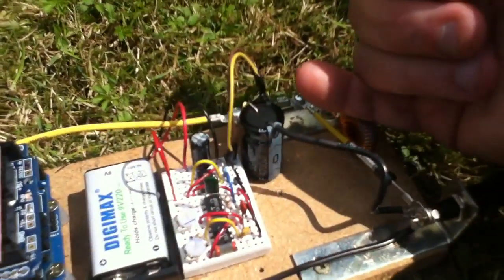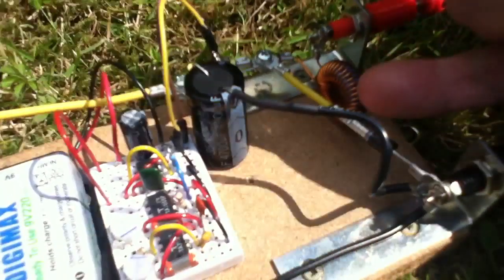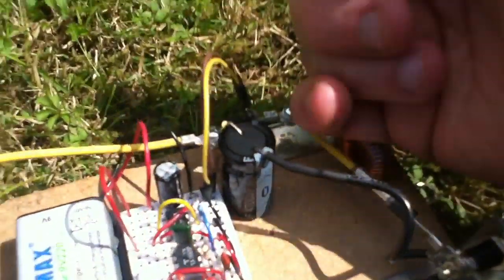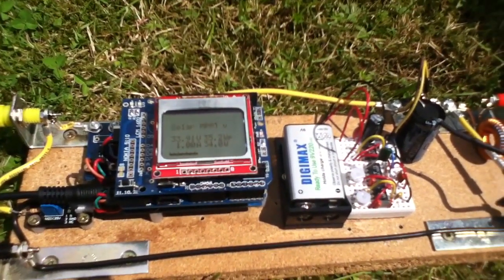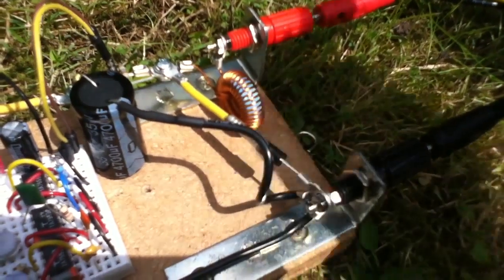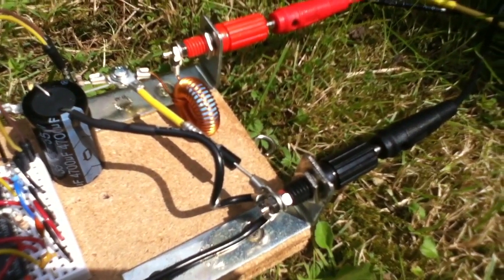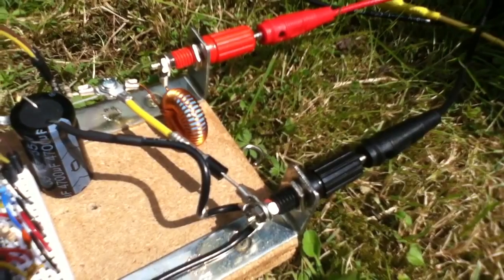The inductor is getting pretty hot. The diode is just warm, and the MOSFET doesn't feel warm — so inductor hot means it's working fairly hard. From the last scope session I noticed there was ringing on the inductor at the point of collapse when it lost all its charge — it went into high-frequency oscillation way above the switching frequency, maybe around a megahertz or so.